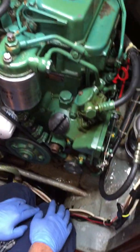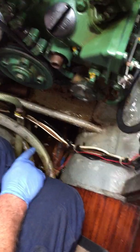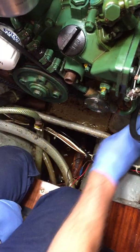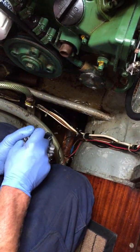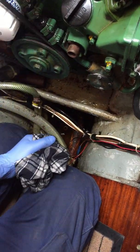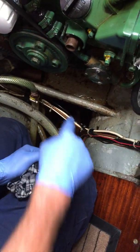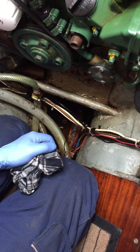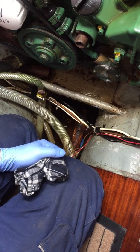We've got water in the bilge - is that the shaft perhaps? If it's running down this way - which it doesn't look like it is, because they put these little collection traps in - then yes, possibly the shaft. There was a little bit of diesel in here before but that's just been from the amount of times it's been bled recently. If water's in the bilge down there and there's nothing collecting up here, it's coming from here forwards - so skin fittings, seacocks, hoses, drains - I'd be checking all of that.